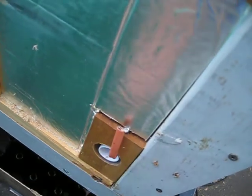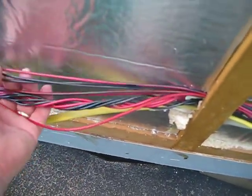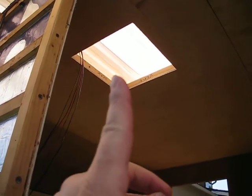On this side, again, this would be the shore power coming in — 30-amp service. We have 120 right now running back to the back shelf; the wire comes in right there and feeds into that shelf. I'll run the 12-volt wiring tomorrow. This is where all the wires come in and go into the power distribution center — all the wiring for the 12-volt and the 120. This is the dedicated circuit that goes to the kitchen, and there's the kitchen window. Looking up into the vent hole — that will have the FANTASTIC up there.